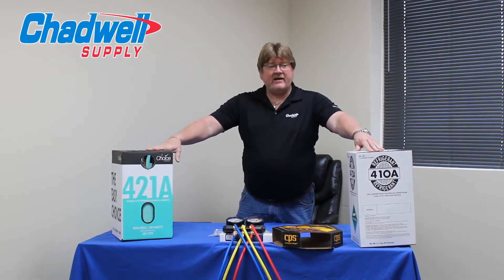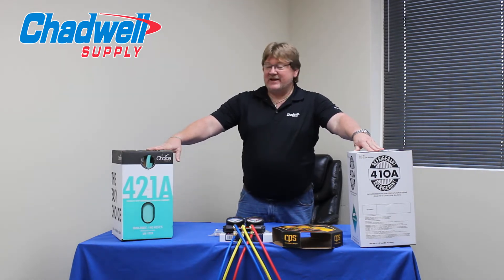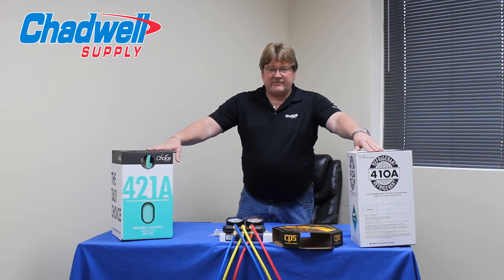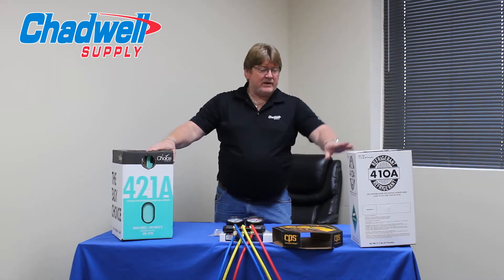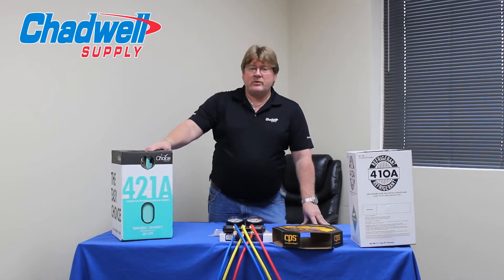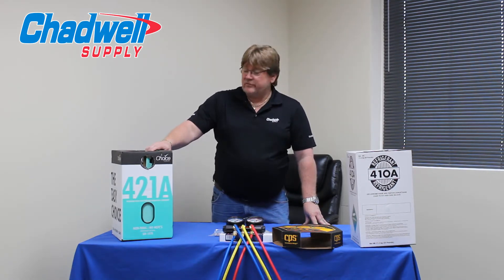We do need to have a replacement refrigerant in our toolbox. With so many choices, the constant question I always get is which one is the best? You have to define what you mean by best — is it efficiency, ease of use, or all around? Each refrigerant has a unique place in the market. For the multifamily housing industry, we need to eventually get to 410A, but in the interim we need a fast alternative we can put into systems without a lot of oil changes and retrofitting — a refrigerant we can drop in.